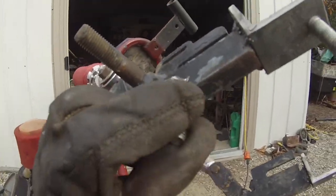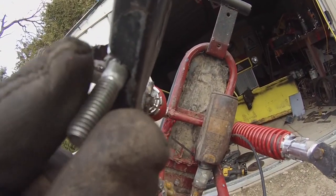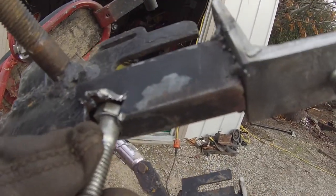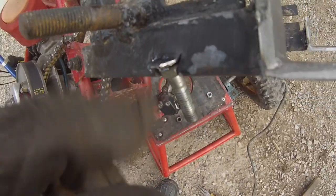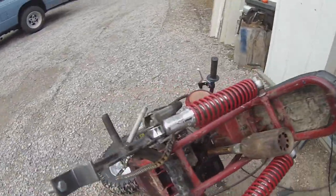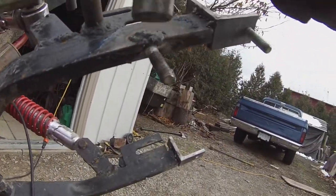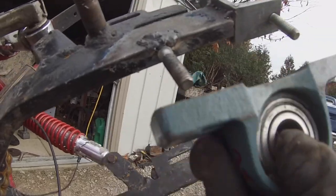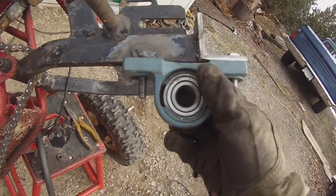Alright, here's what I've come up with — I've made an incision and I'll slot a bolt in there like that, line it up so it touches right there, get it straight. I might even bolt the bearing on and then tack it on top and weld it, then cut this off a little bit. Got the MasterCraft going — not too bad, that's not coming off. The bearing still goes on with no problem, so that should be good.